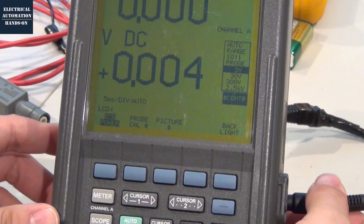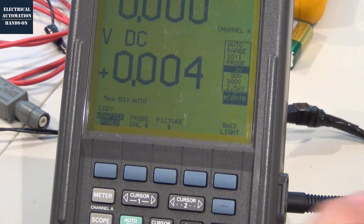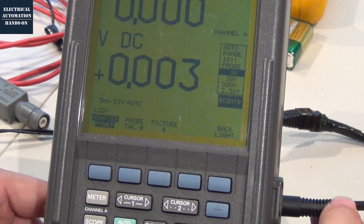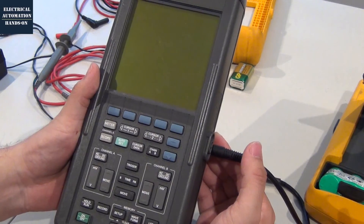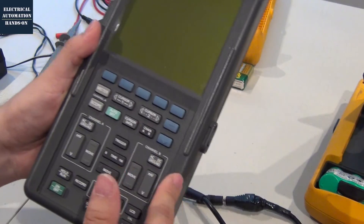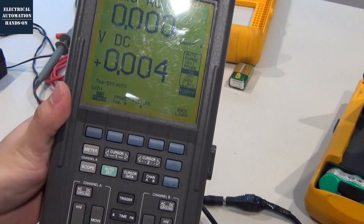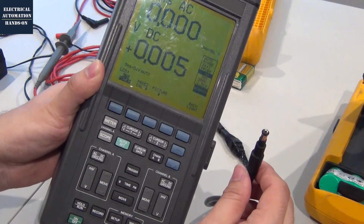And if I connect this AC power to this scope meter, let's see the symbol change. The symbol changed to the adapter. So that means if we connect the AC power to this scope meter and once we have our AC power supply connected, it will shift to the adapter. And then if you walk outside or work in the field, you can disconnect this power supply and just use the battery — the scope meter will shift to battery mode. So the standard battery won't conflict with this AC/DC power supply.